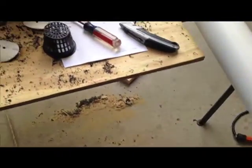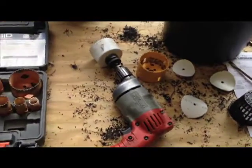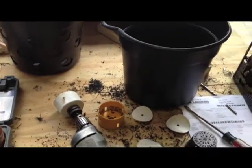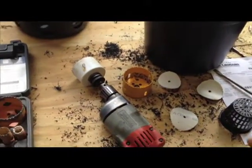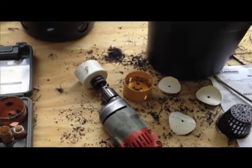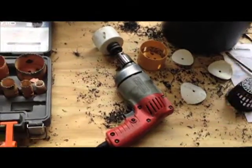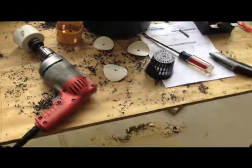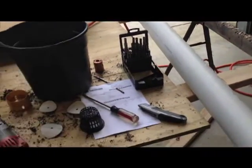To ensure that you don't crack or damage your pipe, I'd suggest running these in reverse. That's a trick also used if you don't have a plexiglass or Lexan bit when drilling that type of composite material — if you run a standard drill bit backwards, you have a better chance of not cracking your piece. I attempted to use that technique here and it works. So that's my suggestion for drilling pipe. I'm going to get to it now.